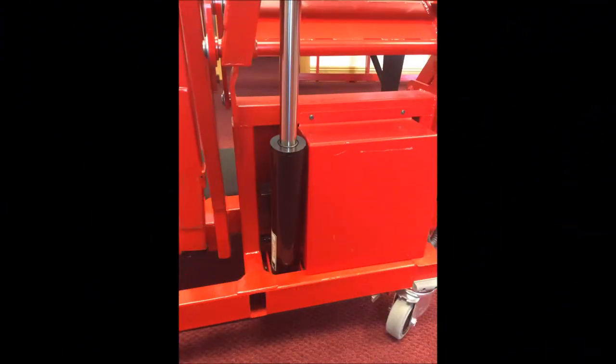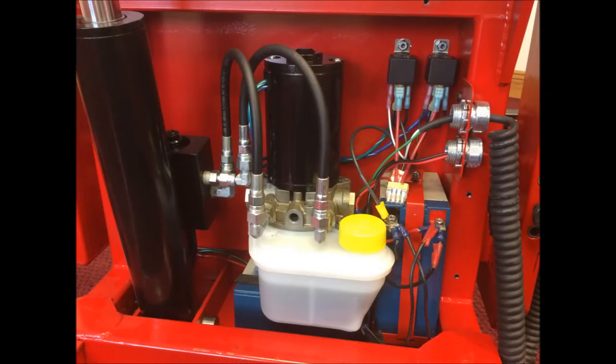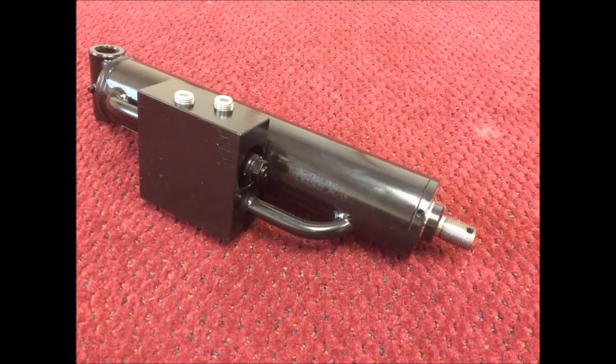The muscle behind the KTT Grand Mover is a self-contained hydraulic system powered by a rechargeable 12-volt battery. The system is so powerful that while moving a 1,200-pound piano, the machine is only operating at about 40% of its capacity. Because of this, pressure relief valves are incorporated into the system to limit the load you can actually lift. The hydraulic pump has been manufactured by Parker for over 30 years and provides the ultimate in dependability. The cylinder, custom manufactured by Bailey International, incorporates double counterbalance valves for smooth operation throughout the entire cycle of the machine.